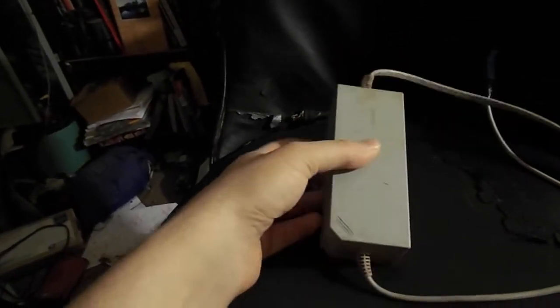Basically what happens is if your radio pulls more current than your adapter is rated for, it can get hot, and you don't want that. You don't want to overheat. So, I've talked enough about this — how do you do it?